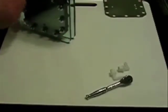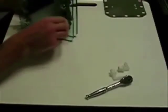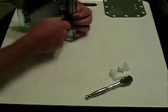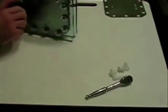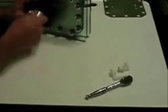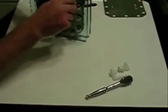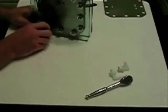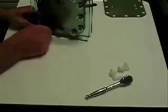That ensures you're getting even pressure all the way around. You don't ever want to over-tighten this material — for a gasket or any other gasket material — as you're liable to damage it. Believe me, you don't want to fill these up with electrolyte and then have to go back and tear it all apart.